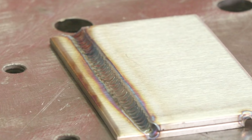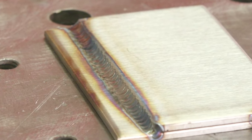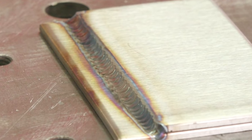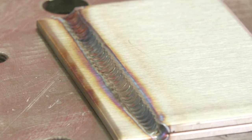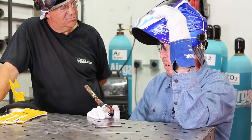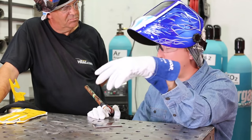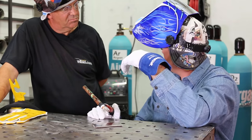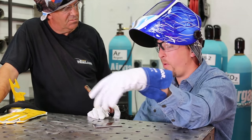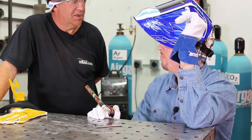On 12-gauge it's not so thin that you have to be extremely careful about blowing it up. It's thick enough where you can make some time on it, put some heat in it and go. As long as I don't get suck-back or porosity on the opposite side — everything I'm doing is passivated, food-grade quality. Once it's all tacked together you can really crank it up. You want the machine set good enough to get a decent puddle, but I don't ever set it too high. The guy that taught me ran his machine incredibly hot — he said you've got the foot pedal for a reason.